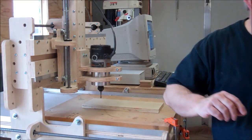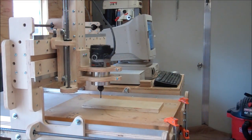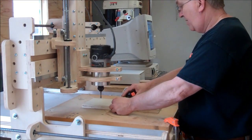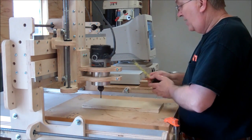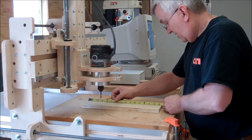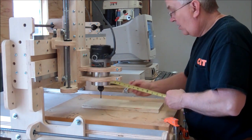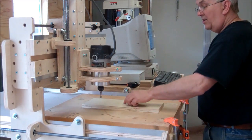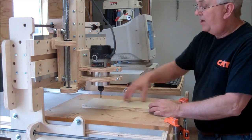Now I'm going to run a little program — actually the program to make another one of these router mount blocks. What I like to do is take my tape measure and pencil. I know the blank I need is seven by five and this piece is way big enough. I'm going to put a mark right in the center of this material. I'm at fifteen and a half inches, so half of that is about seven and three-quarters. I put a little mark there. Since my program starts at zero in the middle of the material, as long as the piece is big enough it doesn't have to be exactly centered.